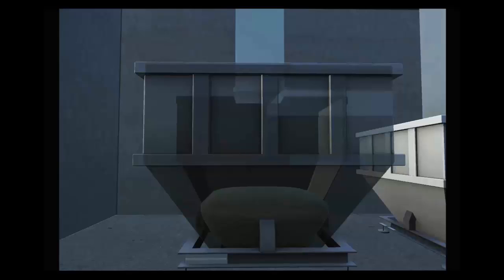If a facility does not use an air gate, it will use a screw conveyor located under each ingredient bin above the major scale to move the ingredients from the bins to the scales. The facility jogs the conveyor, or turns the conveyor off and on quickly, to move a small amount of material onto the scale once the amount is close to its target weight. Once the target weight is achieved, the screw conveyor stops and the weight of the ingredient is recorded in the system or on a batch sheet.